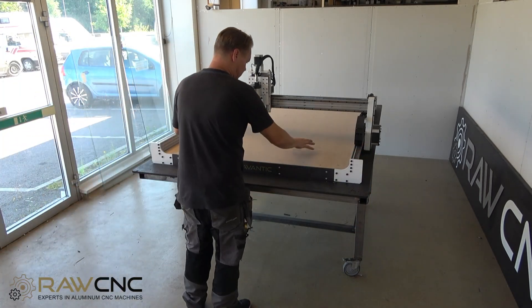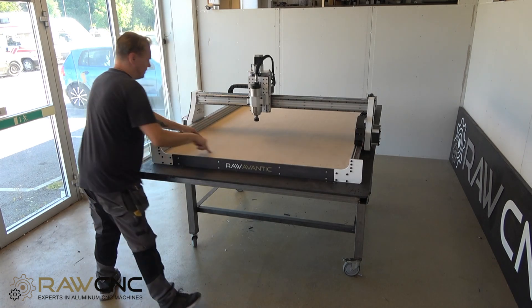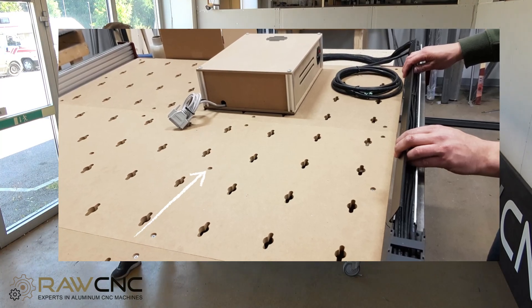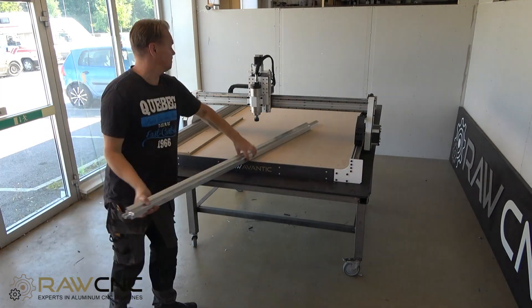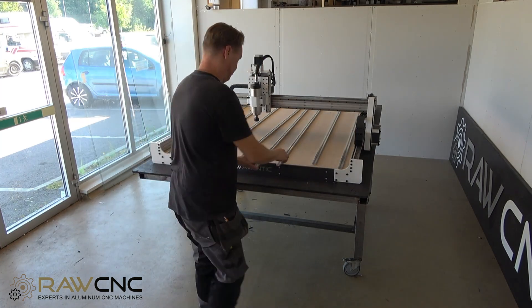You can use the table as it is now and attach your pieces with screws or drill holes for your clamps. If you settle for this table, you need to fasten the table both at the front and in the middle of the profiles. The hole for the screw must then be countersunk so that the insert does not touch the screw when you cut. But if you want to build on the table with another layer that has both rails and a replaceable consumption table, you can follow these steps.